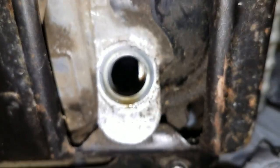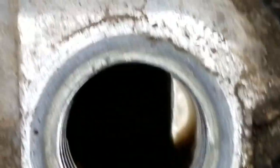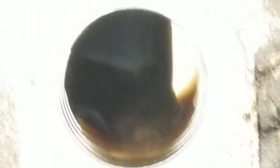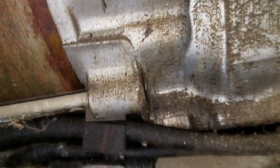I just had that oil laying around. I originally bought it for Bridget's old car, which had a blown head gasket — it was drinking its own oil and coolant. I bought that bottle to top up her car when necessary, but then she ended up getting a new car, so I never used it. I figured I'd just put it in the generator. Honda recommends 10W30 or 10W40, and this is 5W30, but I'm not too worried — it's certainly going to work better than the old oil that was in it.